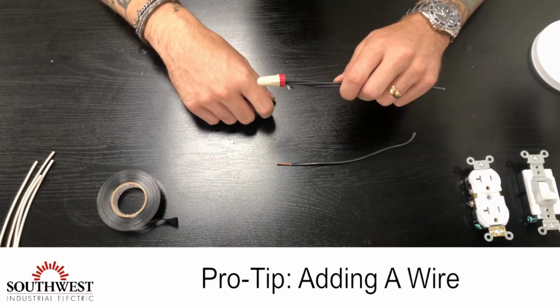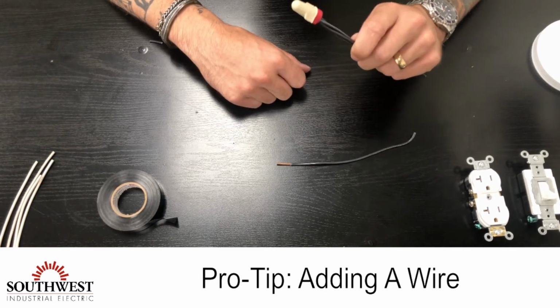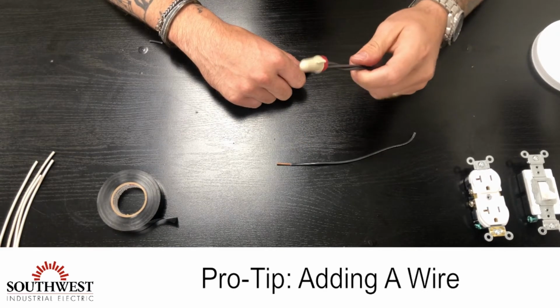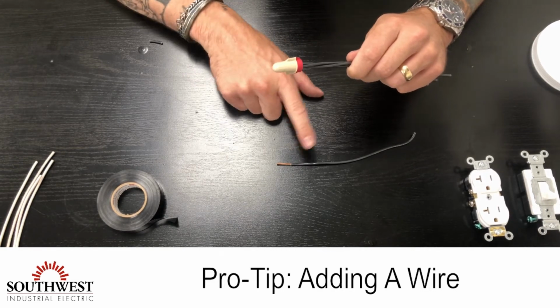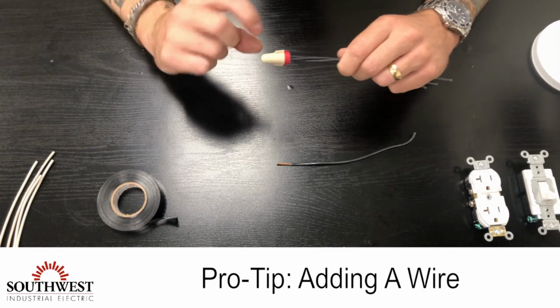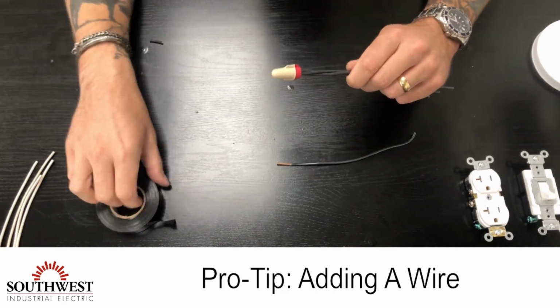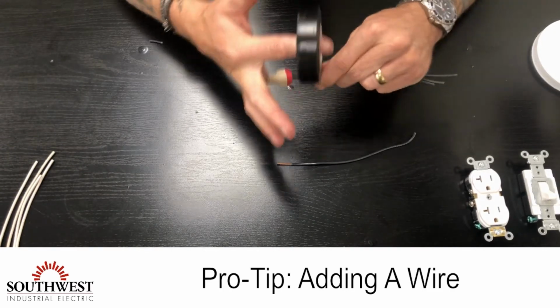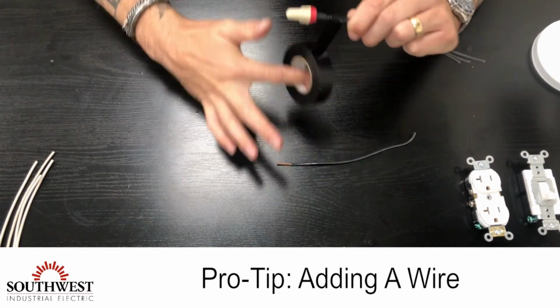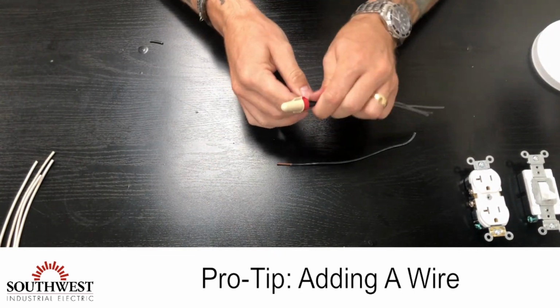So here's a tip for adding a wire to an already existing wire nut connection. In this particular instance, I have 3 wires already wire nutted together, and I want to add 1 wire. When I remove this, I want to make sure all the wires stay together and they don't start to come apart. So before removing the wire nut, I'll put tape around the wires all the way up to the wire nut, nice and tight.